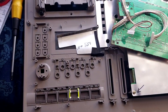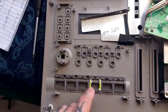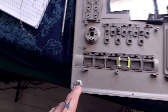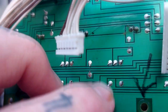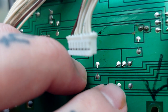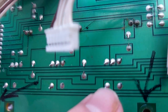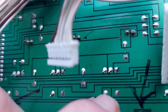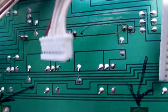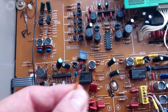I've now removed the control board. You can see where I've previously done repairs to the plastics, the broken button, and a couple of broken mounting post standoffs. The play problem is the same thing again - you can see more clearly this time, if I push on it with my fingernail I can make the gap wider. Pressure on that has actually cracked the solder, so I'm not going to replace the switch - I'm just going to introduce fresh solder to restore the electrical connection, and that will fix the play issue.